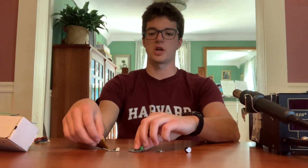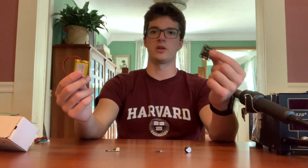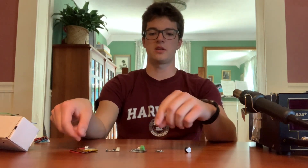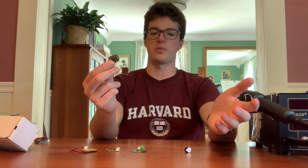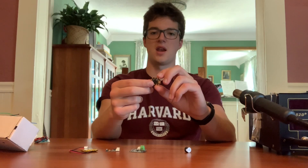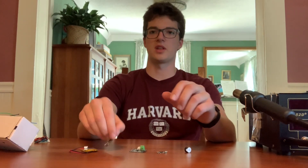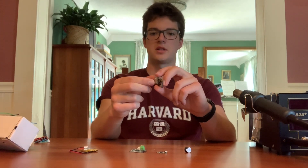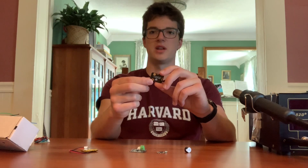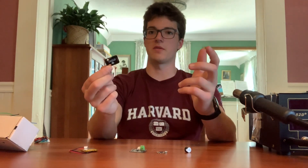We're going to power the project through a lithium ion polymer battery and a lithium ion polymer battery charger. This microcontroller needs five volts to operate correctly but I think it'll be fine with 3.7 volts coming from the battery and it shouldn't cause too many problems. And lastly, the thing that's actually going to detect the lightning is this lightning sensor from DF Robot. It detects electromagnetic radiation from the lightning strike, and I'm hoping that it's going to work in this enclosure — so let's give it a try.